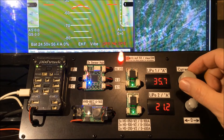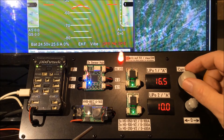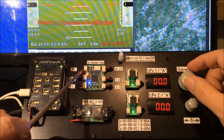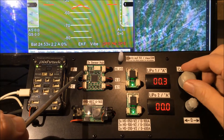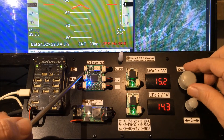So if we are landing, the sensor board will switch off the alarm at the moment we touch down and the current reduces to zero. We don't want a very noisy copter on the current reading, so we have one minute to go to the copter and check which battery gave the alarm. In this case I reduced the time to 10 seconds to better explain things. The alarm will be reset either by waiting one minute in standby or by disconnecting and reconnecting the battery.